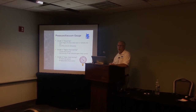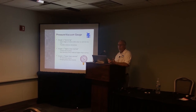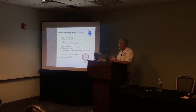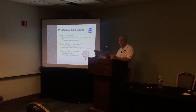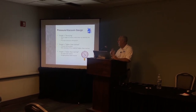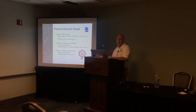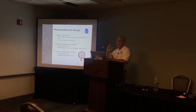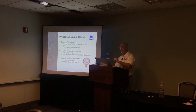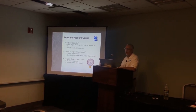If you see a pressure gauge on a blower that's bouncing — going up, falling down, going up, falling down — that is a strong indication you're starting to see rotary valve wear. It could also indicate a controls issue, where a control system senses high pressure, shuts off a feed device, lets it correct, and then takes off again. So be aware it could be a controls interaction.